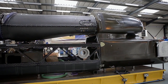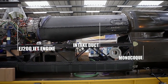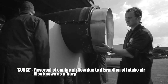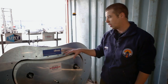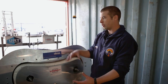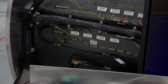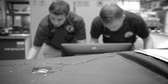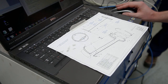Today we're doing a jet intake duct test. The reason is to check that should the jet engine surge, the inlet duct on the car will not burst. This is the front of the inlet duct. On here you can see a couple of sensors for today's test. We've got pressure sensors inside the bag which is pumping up the inlet duct, as well as strain gauges which measure the strain on this inlet duct as we pump it up, so that our stress engineers can check that the modelled strain matches reality. That's the point of today's test.